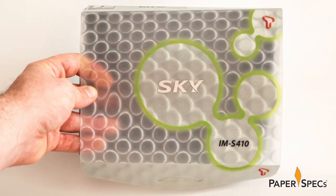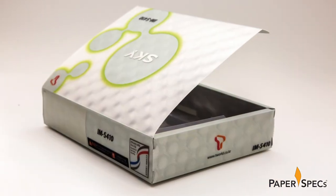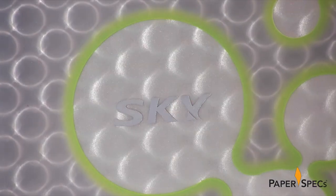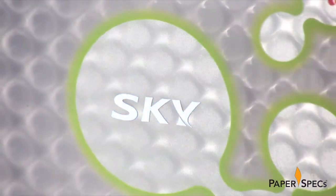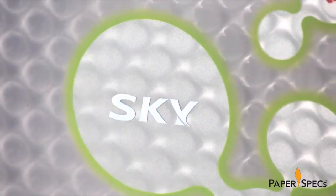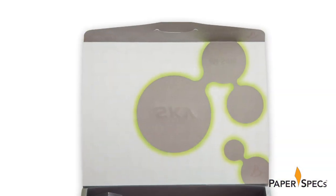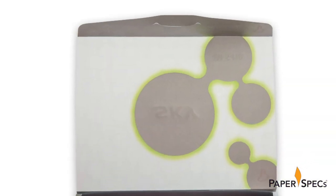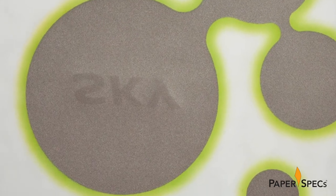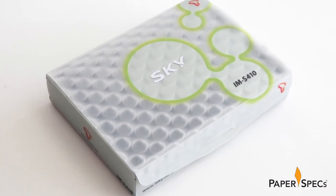The captivating bubble pattern gives the effect of lenticular printing, a three-dimensional illusion, but in this case there's no need for extra software or heavy design work. With the 3D built right into the substrate itself, depending on how you position the artwork, it can have a profound effect when it comes to enhancing that third-dimensional quality. In this case, to create a feeling of depth, silver was printed on the back in the area behind the circles, and green was printed on the front outlining the circles, which heightens the overall illusion of depth.